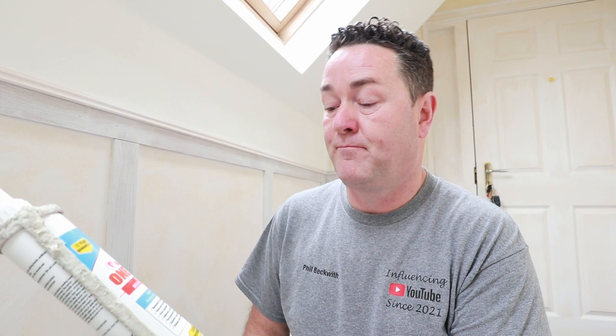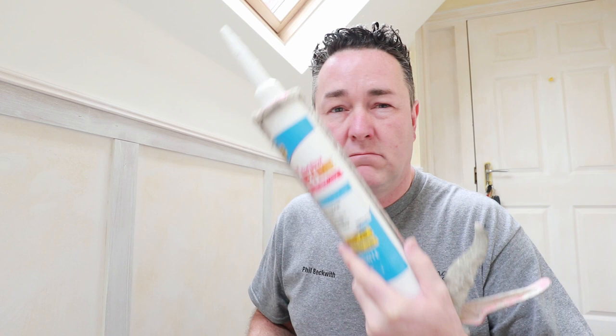I'll fill over them lightly once they've dried — because it's an acrylic watery base, it won't take long to dry. Just give them a fine nib down with a Mirka Goldflex 150, lightly sand them down. If they need a second fill you can go around again — that's not a problem. Now the other thing I'm going to do — my favourite caulk. You can't buy any better caulk than this. It's a couple of quid a tube, not very expensive: the Red Devil One-Time Filler, interior/exterior. There's a flexibility to it, dries within about half an hour, and I can be painting or spraying it. I don't see any crazing.